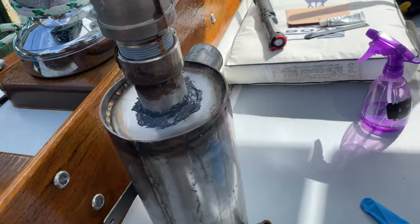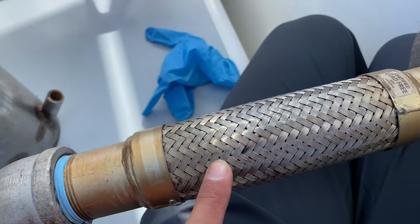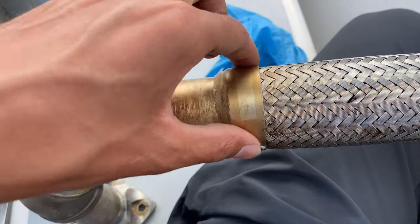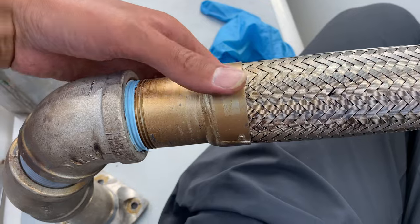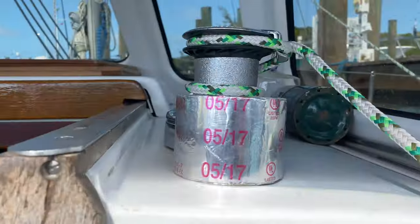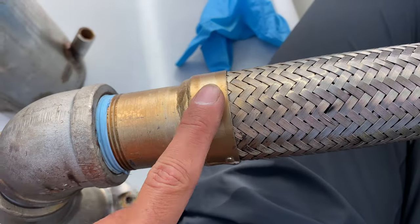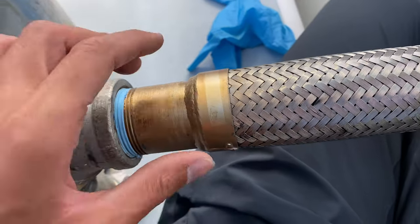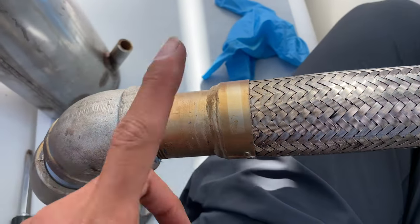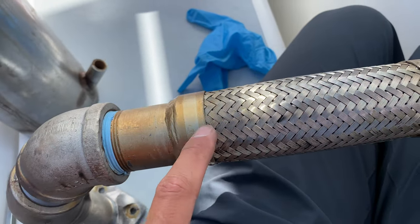While this is drying, I have to address this. So this flex pipe is necessary, and I can't use a wet exhaust hose because this is a dry part of the exhaust. These are fairly smooth flanges where this is pressed into. I have some high heat HVAC tape. It's metal tape, it can go up to about 250 degrees. I think that it will be able to withstand this. And it's metal, it's not like it can catch fire or anything.